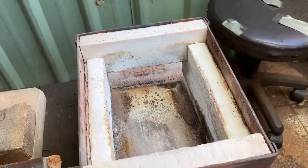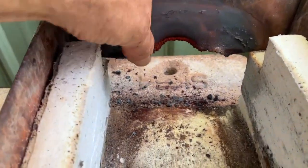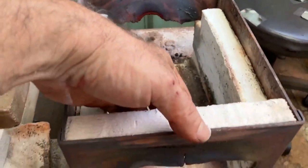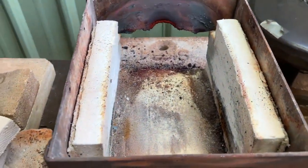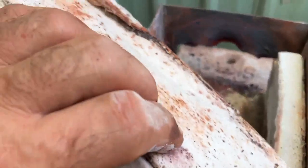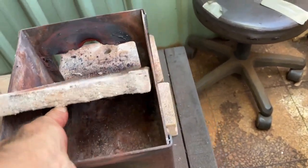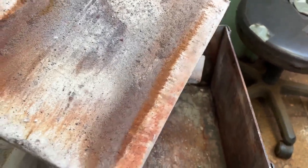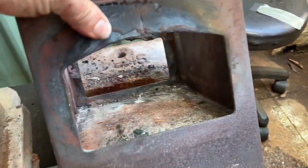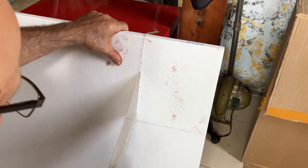It's definitely time to change that hard ceramic. The way I configured the refractory last time I relined didn't protect the front and back of this forge shell, so I've got to do a better job of that otherwise this is quickly on its way out. It may be unrecognizable but this is a Diamondback Ironworks forge and I would recommend them every day of the week and twice on Sunday. I've relined this several times but I've used this forge for 12 years, virtually six days a week.